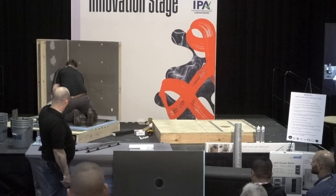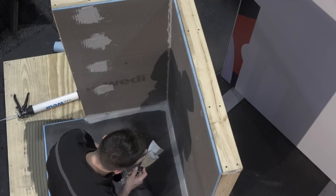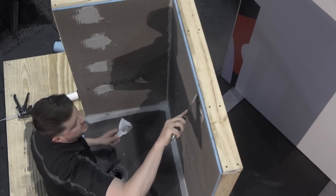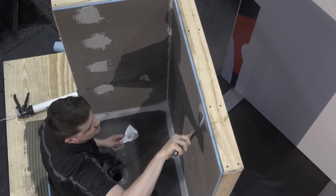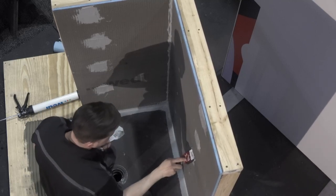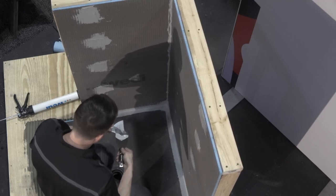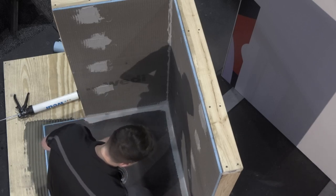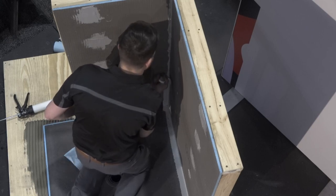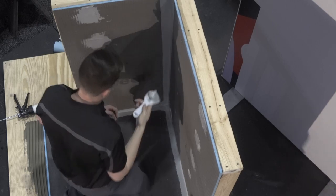Greg is covering the screws and washers with sealant — that's also part of the specifications. The sealant in between, the topical application spread flat to one inch past the seam in both directions. You also cover the washers and ensure the sealant is one inch outside the perimeter of the washer as well. He's tooling out the sealant, then he's going to simply apply our curb.